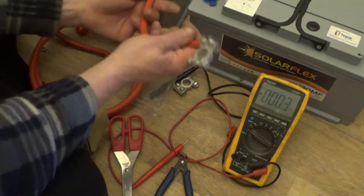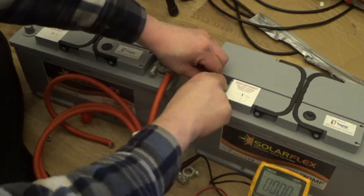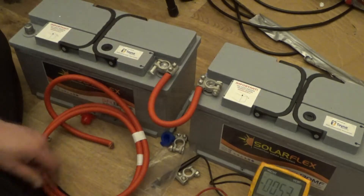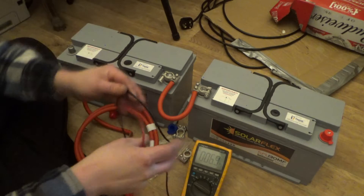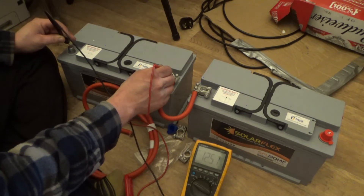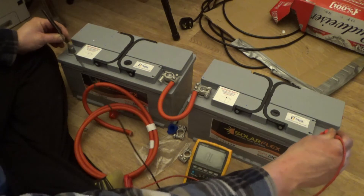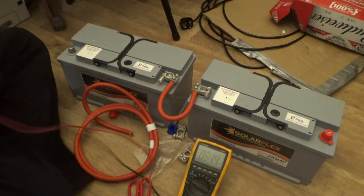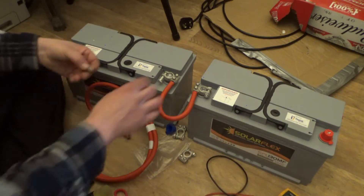Positive is connected — there we go. The battery bank was originally at 12.51 volts per cell, and across the entire pack we now have 24.97 volts, which is ideal. That's our 24-volt system confirmed. We've also lost a nut off one terminal, so I'll put that back on.